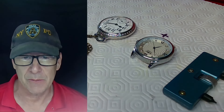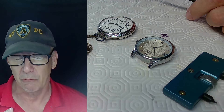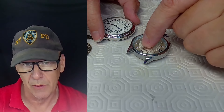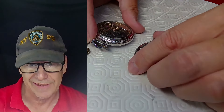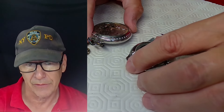Today's video is about opening watch case backs. There are two reasons you open a watch case back: one is to get access to the movement to regulate it, and the second is to remove the movement as part of a watch servicing. We'll go through the various case back openers from very simple to very complex. I have two standard wristwatches — one with a screw-on case back — and two pocket watches, one also with a screw-on case back.